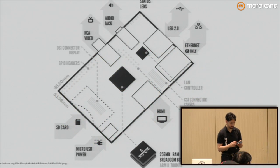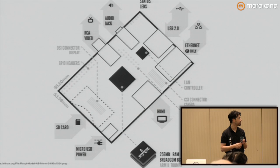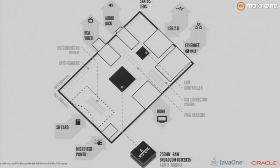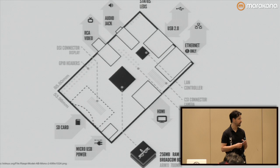I have some of the specs on the next page. The processor — the system on a chip — is the Broadcom BCM 2835. The Model B has 512 megabytes of memory so you can run real programs on it. It runs at 700 megahertz by default but you can crank it up to a gigahertz overclocking it, and it runs cool enough you don't even need a fan or heat sink. This is an ARM 11, so it's an ARMv6 processor, and you can run full Linux on it — Debian, Arch Linux, and a couple other distributions. Ubuntu doesn't work because they stuck with ARMv7 for their releases.